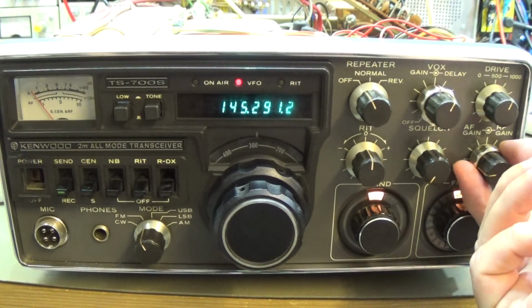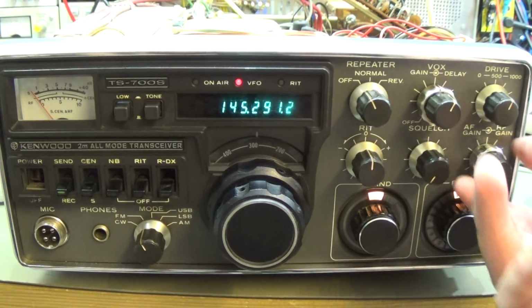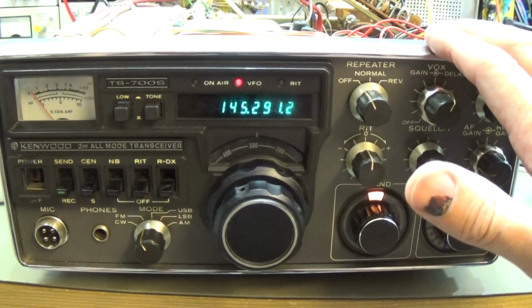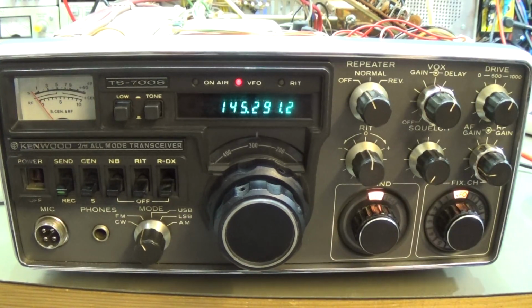So you may ask what this RF gain adjustment does. You are simply changing the AGC, and the AGC is the automatic gain control, right? So what is it for? Very simple. If you get a very strong antenna signal into your radio, then you do not want your front end overdriven, and therefore the automatic gain control notices that there is a really strong input signal, and it will reduce the amplification of our front end transistors. So you can change the amplification with the automatic gain control.